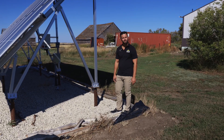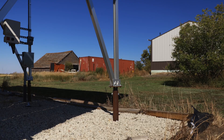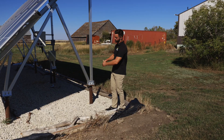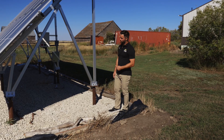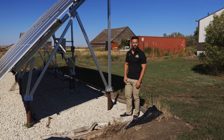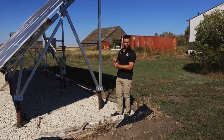I'm going to give you a quick rundown on how we typically install this DIY ground mount system. The first thing you're going to install is your piles. We're going to do a pile layout — we pre-plan it so you know exactly what the spacing is from front to back as well as side to side. After you've put your screw piles in the ground, you're going to put these uprights in place. They're pre-assembled, so all you're doing is unfolding them, getting them level, and then torquing the nuts on them.